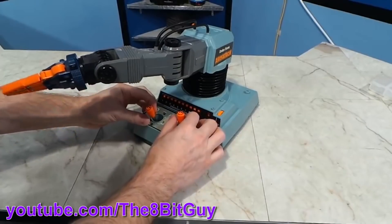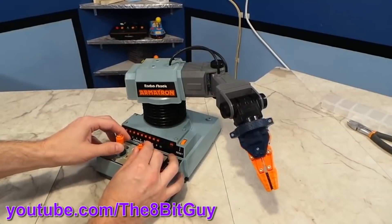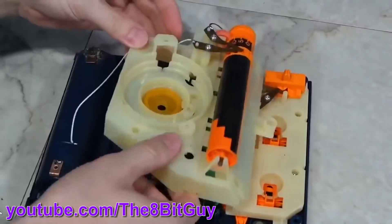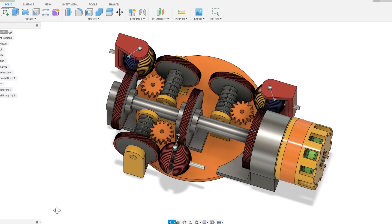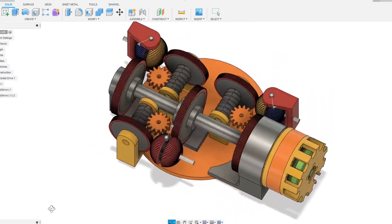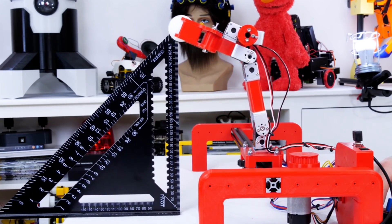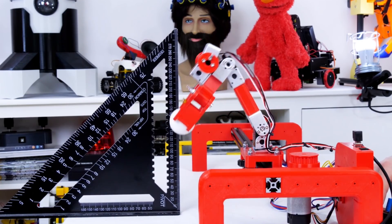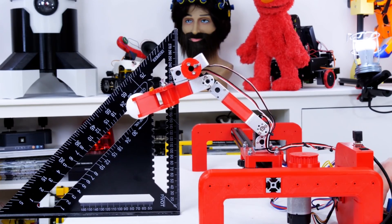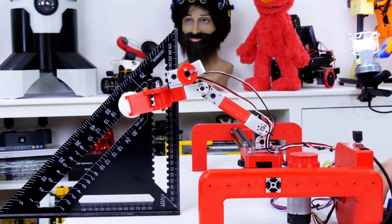Something similar has been done before in the 80s by Tomy who made a toy called Armatron. This used one main motor which ran continually and a series of complicated clutches driven by the control sticks to drive all of the outputs. My version is going to be a bit larger and chunkier but it'll have three continuously variable transmissions so we can speed control the outputs. This should allow us to run inverse kinematics on the robot, which allows the end effector to move in straight lines along a path interpolating the start and end positions over time.